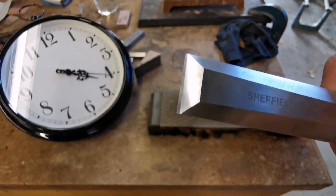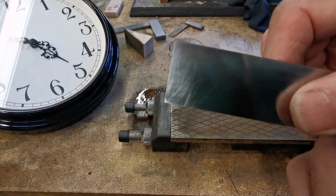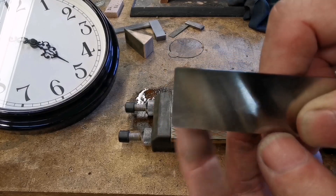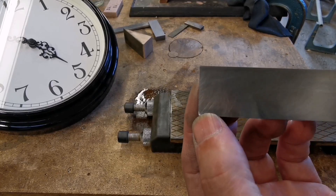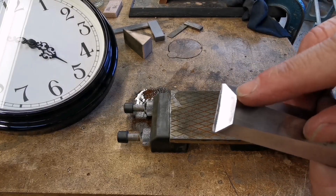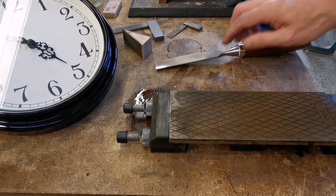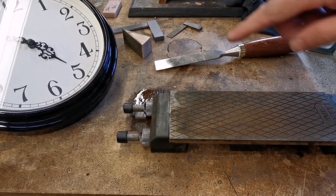Right, carry on. I'm down to the last tiny little bit. There's a little bit on this corner — is that small enough to go to a thousand? The good thing is the bevel is square now and it's getting closer, so it wouldn't take much wear to actually get onto flat. I'm going to give up with the 300 now — I'm going to turn it over, put the 1000-grit on it, and start flattening the back on a thousand.